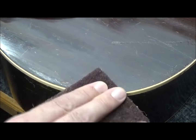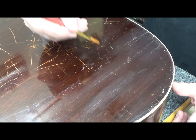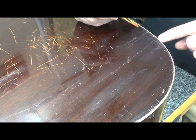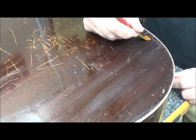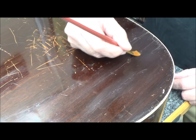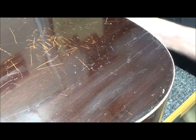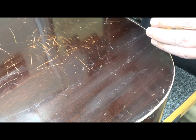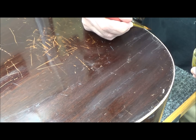I'm going to do a little brush-on. It's missing most of what it needs on this end so I want to start there. This is a three-part shellac, one-part lacquer mix — let's just call it shellacquer.